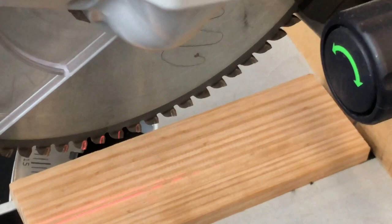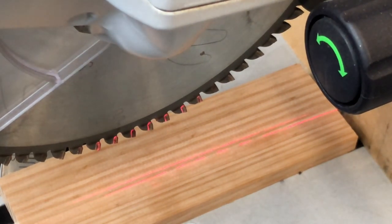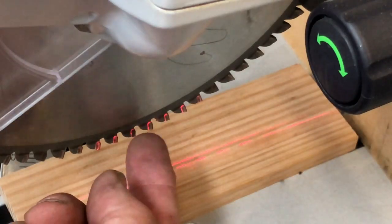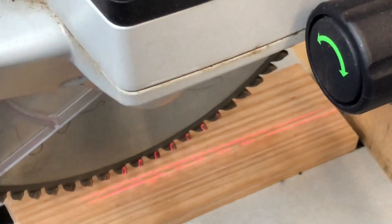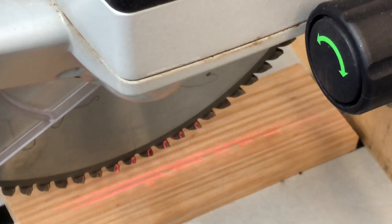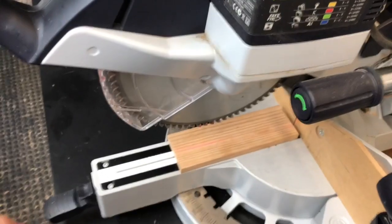Setting these lasers can be a little bit difficult. There are four little screws up the top — it's actually sharp where I'm seeing it. You can see the laser just grazing on the edge of the inside of those tungsten tips, so I think I need to adjust it a little fraction. As it comes down, it grazes against those teeth — I think that's not set correctly, so I really need to sort that out.